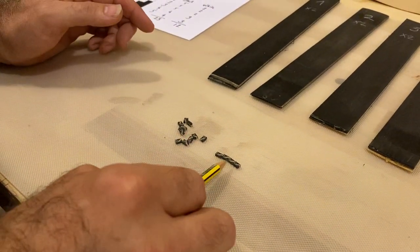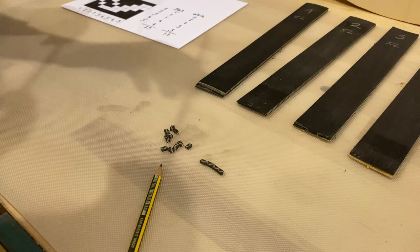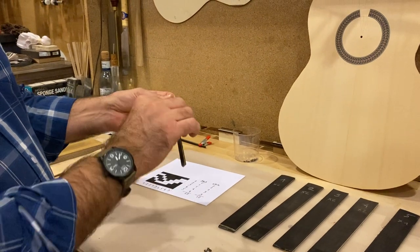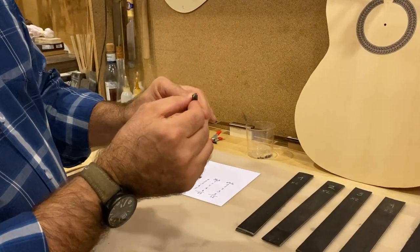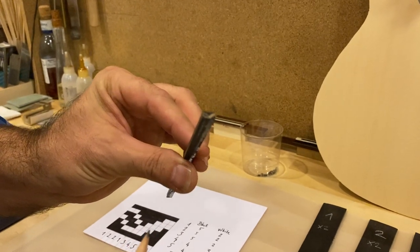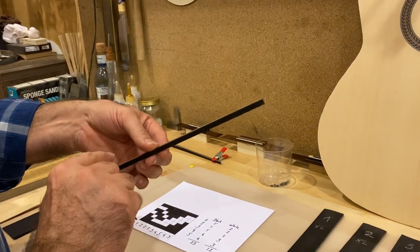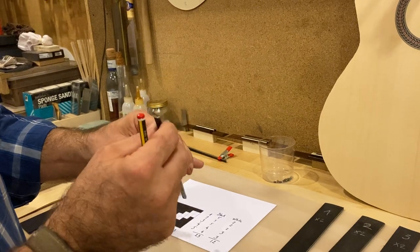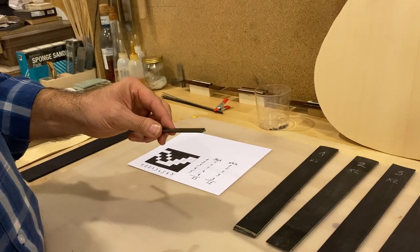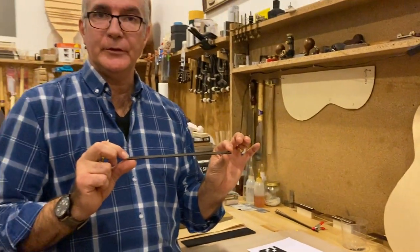So to be able to get to these tiles, they come from a longer rod. This is a long rod, a long stick. And if you look at the end, you can see that you've got that design there. So what we have done is to work all these veneers, which we're going to see in a second, so that you've got the design all the way along the stick. And then as we cut the stick in strips, like if it was a sausage, we get these little tiles. So basically, we need to know how to make a stick like this one.